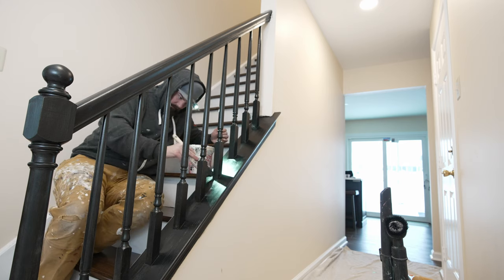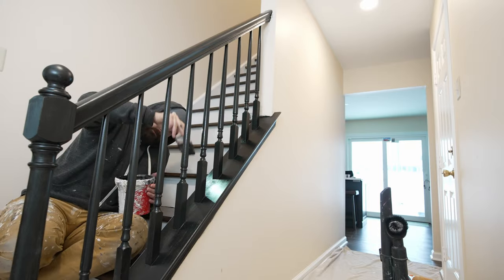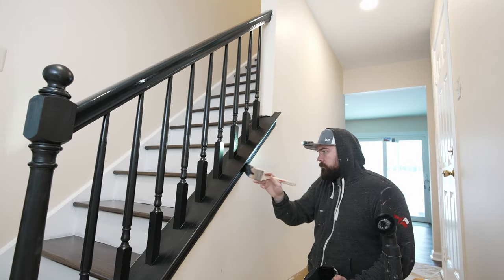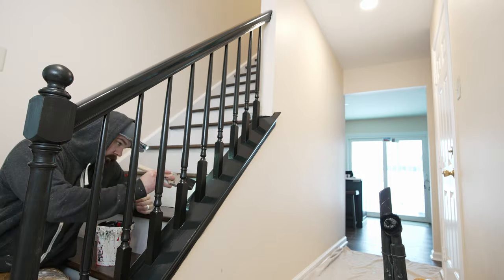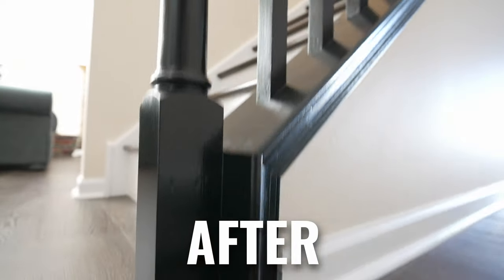The trick I alluded to earlier about how to get the most out of this product is to allow enough dry time between coats. On the can, it says to allow 16 hours between coats. Generally you can move that along a little bit depending on drying conditions and whether or not you're running fans, but if you have the time, it's nice to just do one coat one day and then do another coat the next day. It's also a good idea to sand down that handrail with 220 grit in between coats — just run your hand up and down the handrail where you would typically be using it, see if any burrs are catching your fingers, and sand that down before you apply a second coat. With this handrail, we did two coats and a little bit of a touch-up coat, and it worked out really nicely.